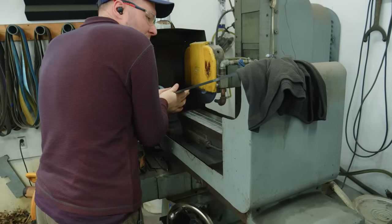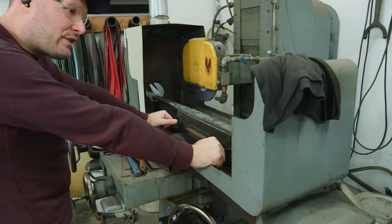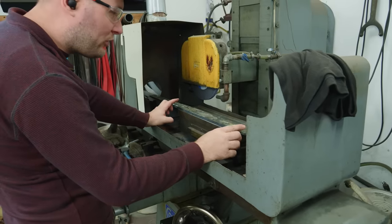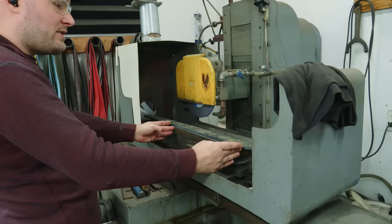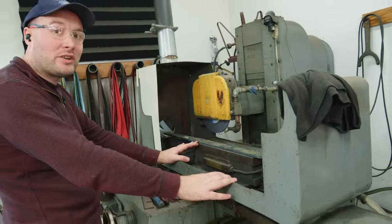Need to be able to work that, plus overlap it a bit. Oh, yeah. I think one hole is enough. I really don't need the other hole there. This is gonna be really tricky. I've gotta surface grind this thing in multiple little sections because the surface grinder only moves about 19 inches. And this entire sword is almost 50 inches long currently.